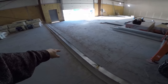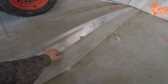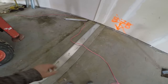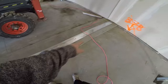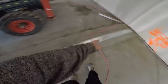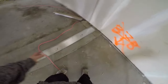Then we came down and did our bottom track. We pre-drilled the holes for the pin bolts because of the 16-gauge steel — the hammer drill bit won't go through it, and if you use regular drill bits you'll be using a lot of them. So we use the step bit because it lasts much longer. With holes pre-drilled, we snapped a chalk line, caulked the bottom with black acoustical sealant, then hammer-drilled it in — pinning one on each side to hold the track in place, getting all tracks in, then going back to drill all the holes and put all the pins in.